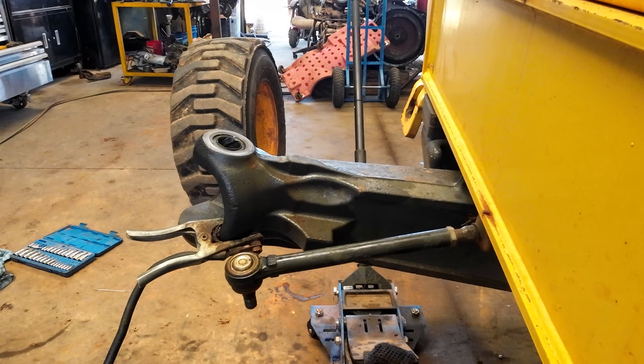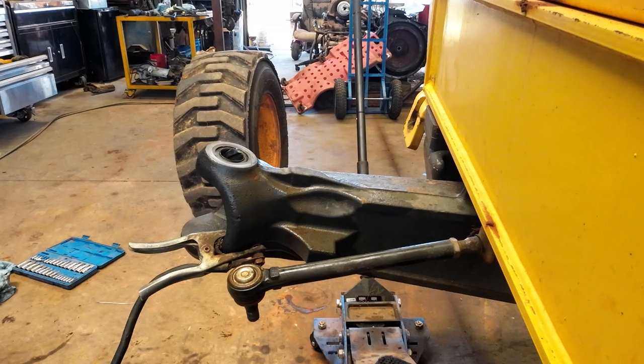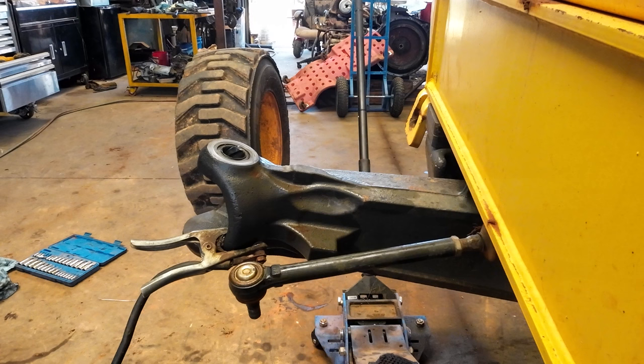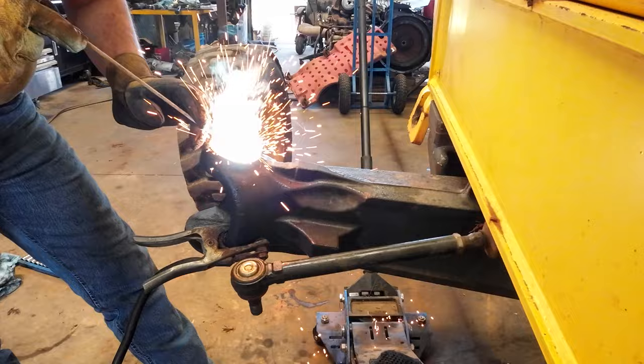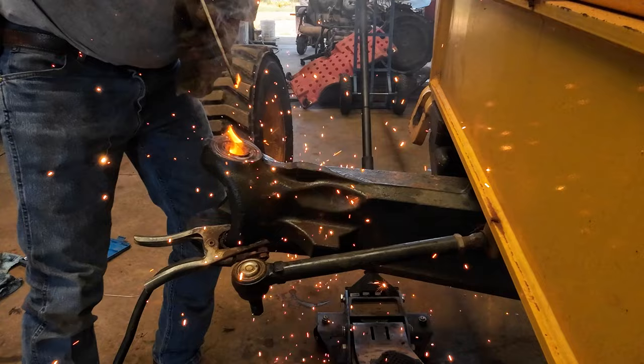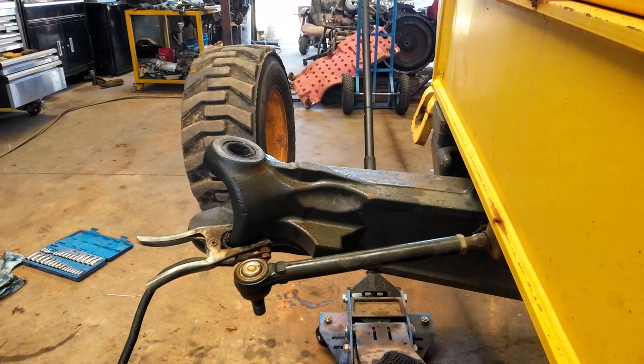This welder is a little bit finicky. I don't know if it's working quite right. Generally, it gets the job done. We'll see. We're not looking for a real pretty bead, but what I'm going to try to do is put one down low and then one up higher, so we'll see how it works. I might need to turn her down just a smidge. I about melted it out of there, I think. We'll go 150. How about that?